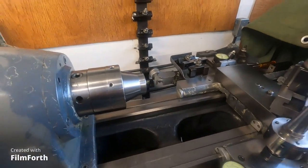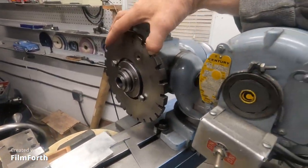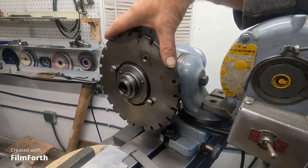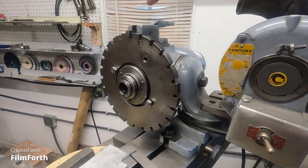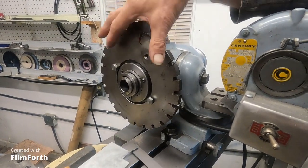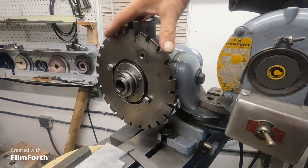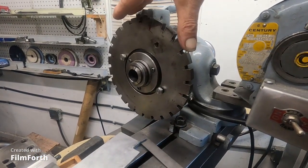And so if you've got a difficult spindle, like the fellow I know got this Monoset, and those are expensive, and the tooling is hard to find, and they've got all these really high dollar collets and stuff like that, and he was missing a couple of them, and he took a look at the price of stuff, and what he ended up doing is piecing all that stuff out on eBay that he didn't need for that Cincinnati Monoset tool and cutter grinder. And he adapted an ER40 collet chuck to the workhead, and it took care of absolutely everything he needed, and he made it adjust true. So, you know, if you've got a difficult spindle or something like that, there's ways around that, and you can get your work running true.